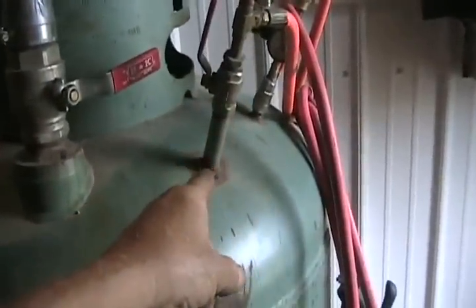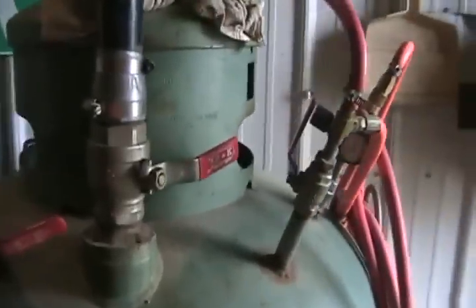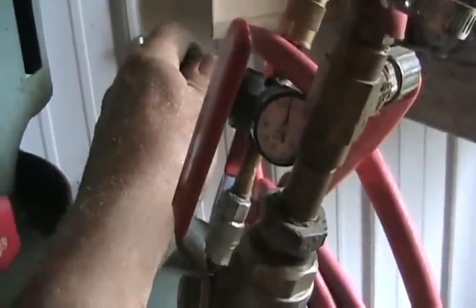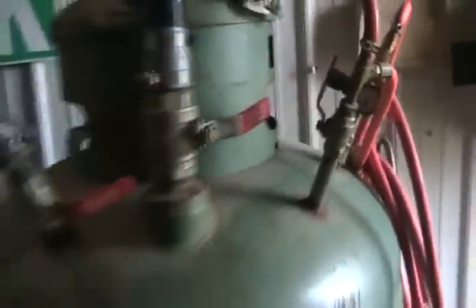That tube is just a piece of steel pipe welded almost all the way to the bottom — it doesn't quite touch the bottom because of sediments from dust on the roof, or maybe a piece of grass or something the birds dropped up there. I can adjust whatever pressure I want in here up to 140 PSI, but I usually keep it at 45 PSI. When you hear it stop hissing, the tank is full.